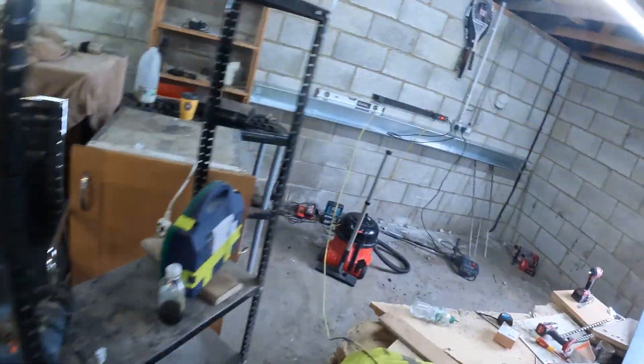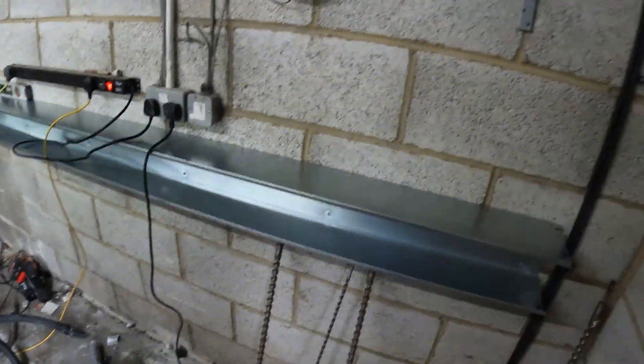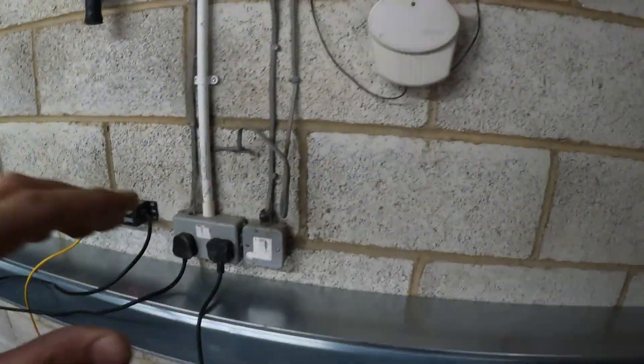So that's got to sit on top of the trunking. We're just going to line that up, sit it on here, draw around it, cut it out. Get some grommet strip on there, or car door strip. And then that'll be that bit done. We're going to leave a little section here for the meter people.